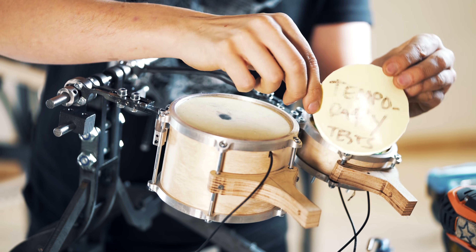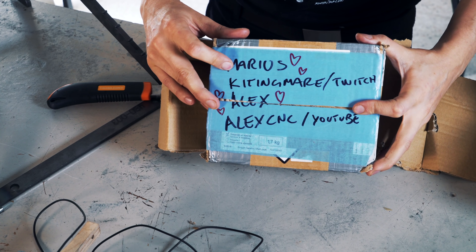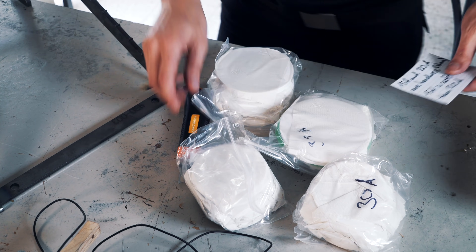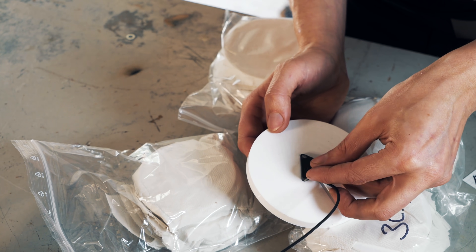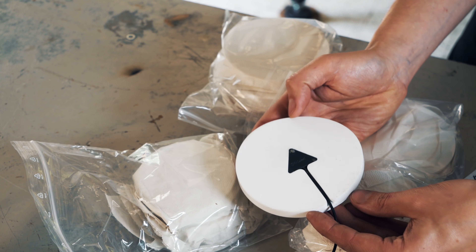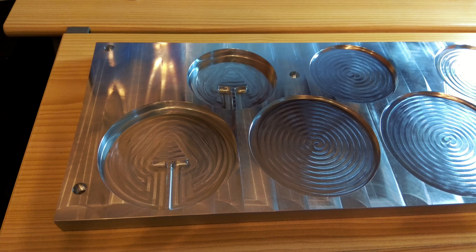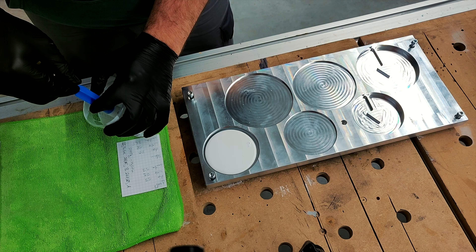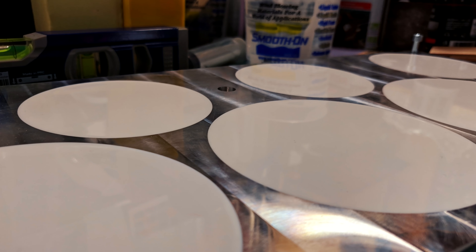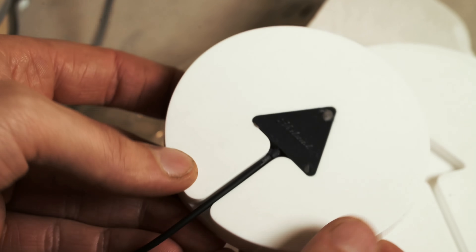These were the temporary test silicone drum heads. In this package I have something very special from two of the most long-term collaborators on the Marble Machine X — Marius and Alex, Precision from Munich. 15A is softer than 30A. It is absolutely spot on. I started by designing the drum heads in CAD, then Alex CNC machined the mold — you can see just how shiny it is — and Marius made the silicone pour. Top level quality on this part, and the bonus that Marius made them in two different thicknesses gives more variety in the sound. Thank you so much.